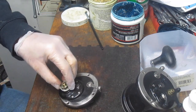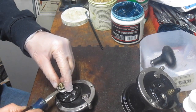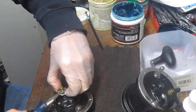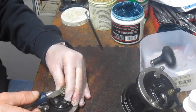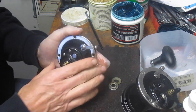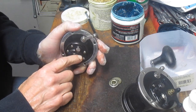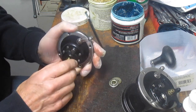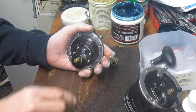These things are always tough to get off for some reason. I'm just going to see if I can pop it up with the screwdriver. Okay, gently — if you have to pry anything, always gently. Here we go with the gearing. This should have a bearing in it. One has a bearing, one doesn't. I think we're going to use this one because I don't like that the other doesn't have a bearing in it. So we're going to take the shaft off this one and put it back on that one.